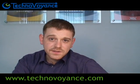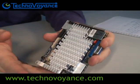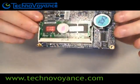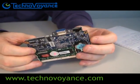Like most of VIA's EPIA range of boards, this board was also designed with the embedded market in mind. It's particularly useful to the embedded market because it has no fan — it uses only a heatsink — so it's particularly good for environments where you want no moving parts. Also, the very low heat and power draw means that it's especially stable. Of course, being Pico ITX, it's also very, very small and compact.